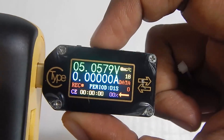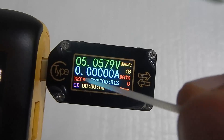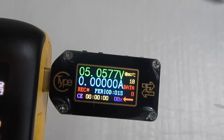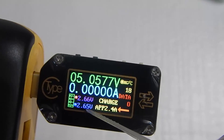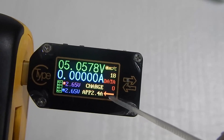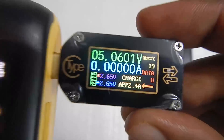If you press K2 again you reach the second page, which again shows voltage, current, temperature, and a data setting where you can record data to external memory on the meter and transfer it to your computer to plot graphs. Press K2 again and another page shows voltage, current, positive and negative data values, temperature, data group, and the detected charging protocol. On different pages you'll also see a directional arrow and charging protocol indicator — once a load is connected the arrow will change to the correct orientation.